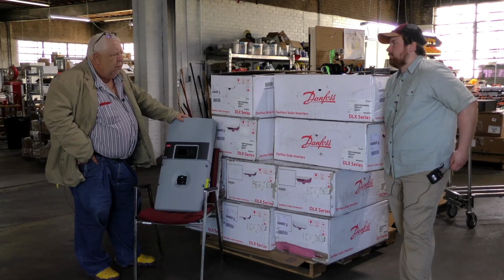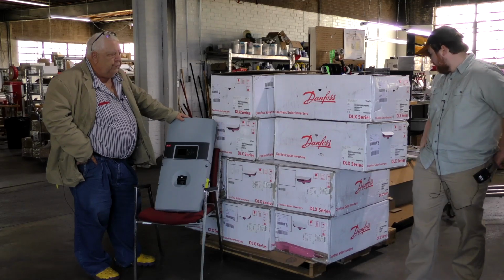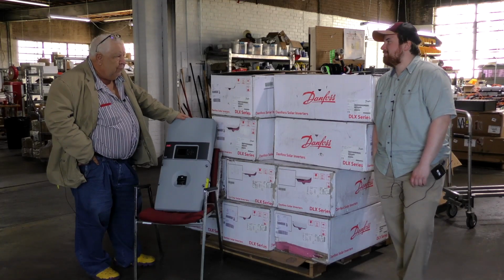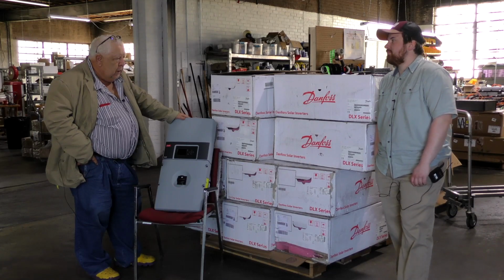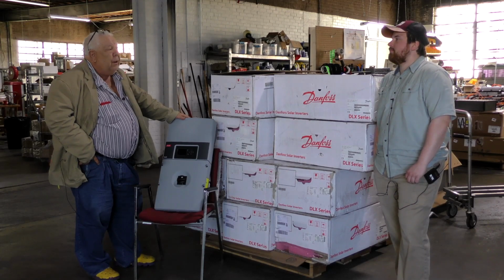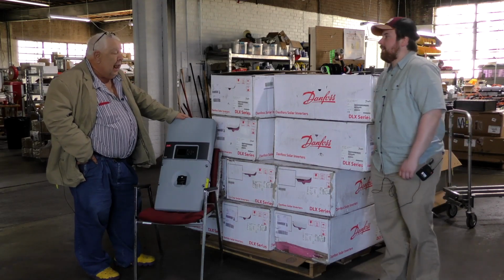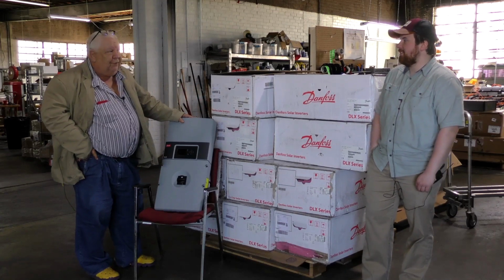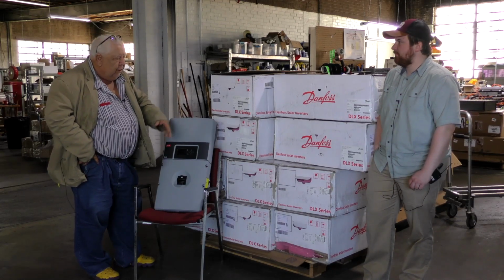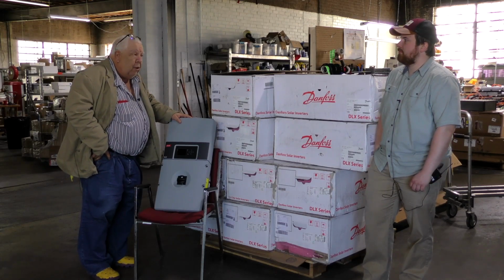I think they came out, the DLX series, in about 2012 or 2013. Why would we be fooling with those? We do off-grid. Well, yes, we do. The obvious thing is that we could hook this up to a full battery pack and make an additional 4.4 kilowatts. And since they're grid-tied, we can line them up and run as many of them as we want. As long as we've got a grid to sync to, we don't have to have these intercommunicated at all. They'll simply synchronize to the waveform and produce power.